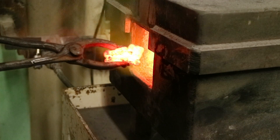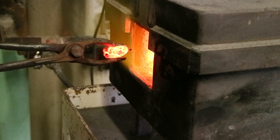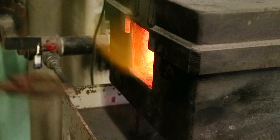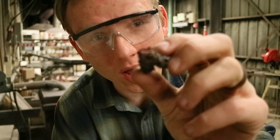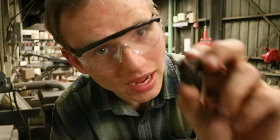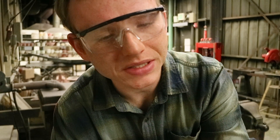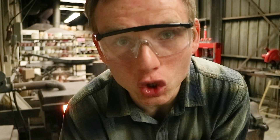I know it's a very iron-rich slag because it's magnetic. It's basically the same as magnetite, which is a form of iron oxide that's naturally magnetic. When I dunk the red hot pieces in water, they rust to a different oxidized state. So there's iron in here, at least the element iron, but it's not in a form that the blacksmith can use.